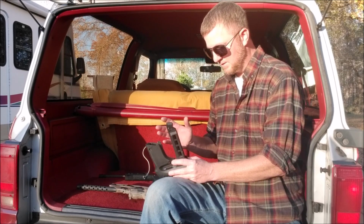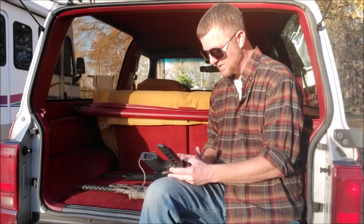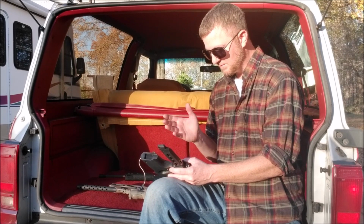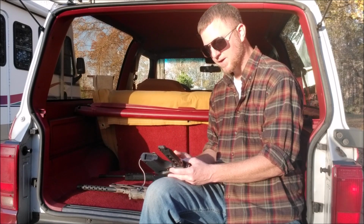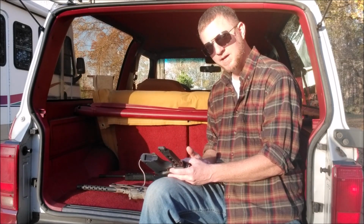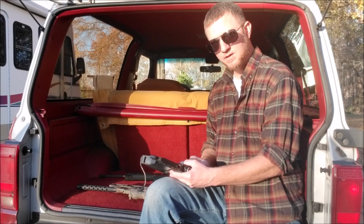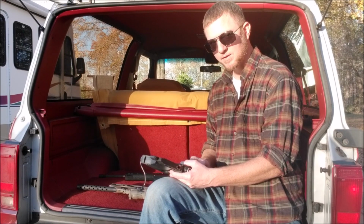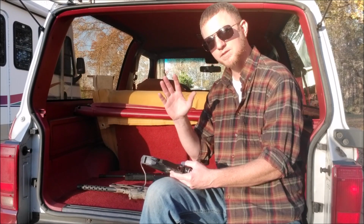So you have that fix, you put a bigger motor in here, and the magnetic auger, and the magnetic auger has a much beefier spring. You put a bunch of voltage behind that, and then you wind up with the polymer in here and the feed channel not being able to handle it, and it can break, it can deform. So there are fixes for that.